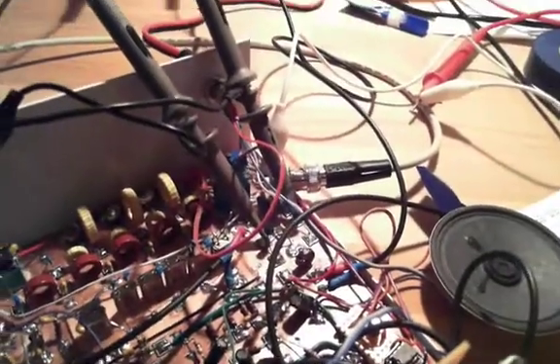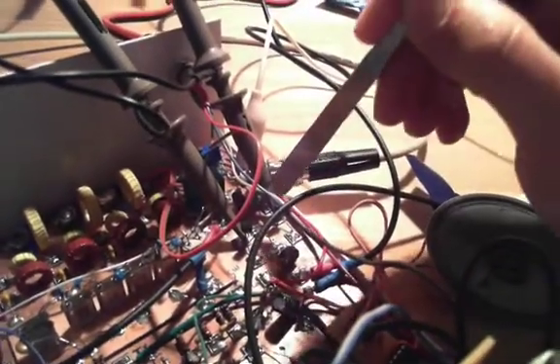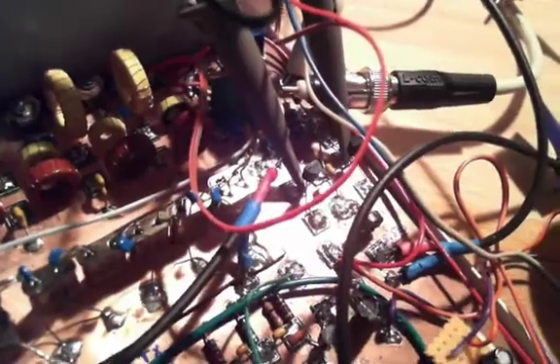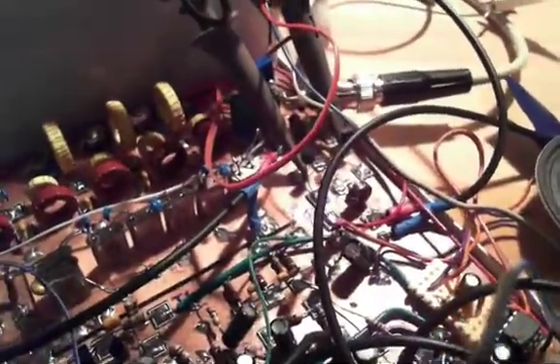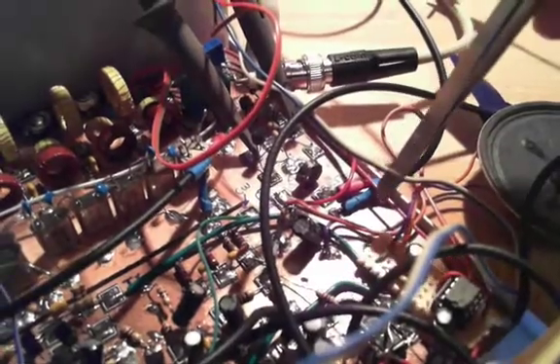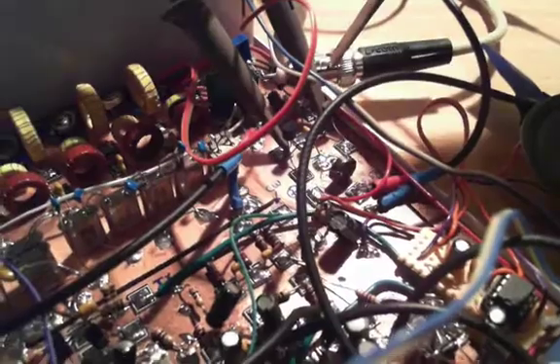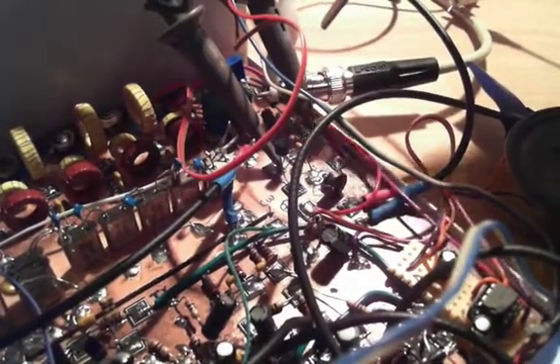So this is my setup. The mixer is actually down here. We have one transformer, another transformer, and one FET and two FET. You probably can't see that very well but you're going to have to trust me on that. I'm not using any of the other circuitry - the Minima is powered but I'm injecting the LO signal here and a signal coming from where the crystal oscillator would be, so an IF signal too. The output, which would be the transmit output before it goes through the low pass filter, is going to my scope and to my spectrum analyzer.